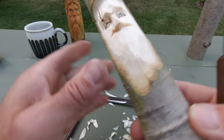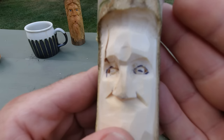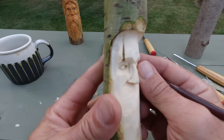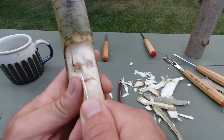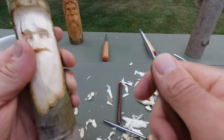I'm going to go wash those pencil marks off for you so we can see when we get to the eyebrows. We've got our eyes cleaned up a little bit. Now we're going to take our v-tool — small v-tool — and come around just above the eye. I'll take a small one — this is a 12-2. Don't get caught up on the tools I'm using. Palm tools are great. I'm putting a little cut straight in here, and hopefully if I just ride this around it's going to stop there.